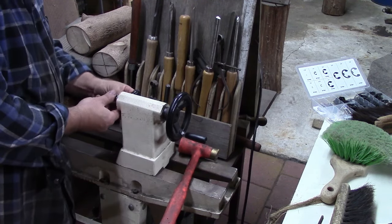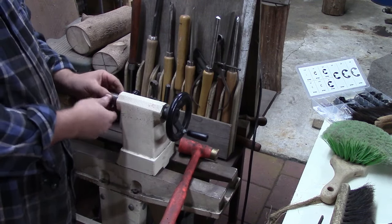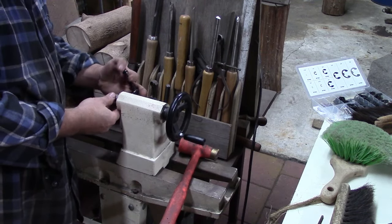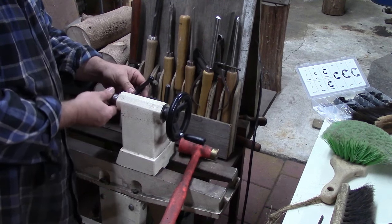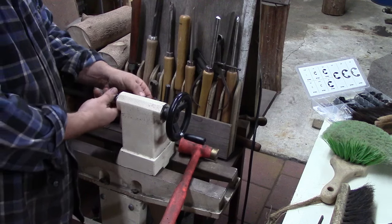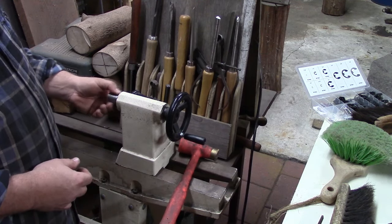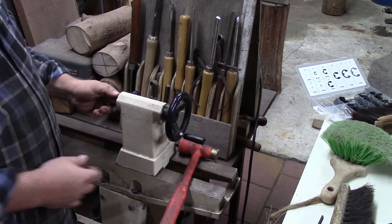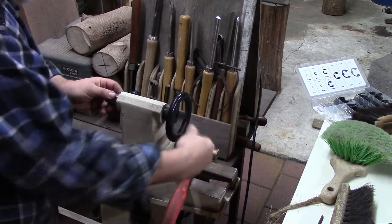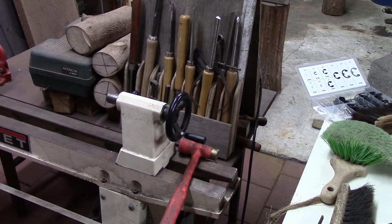And the other thing is this spindle here has a groove in it, and that's where this handle should fit in that groove. As you tighten it, it should tighten in that groove so it's not chewing up your round part here. So when you loosen it, you can turn it, and it stays in that groove, keeps it from just spinning around and around. But that's it.